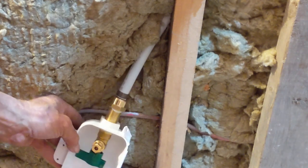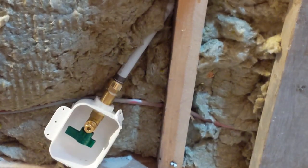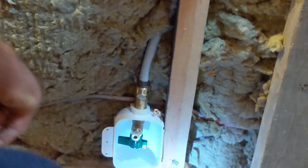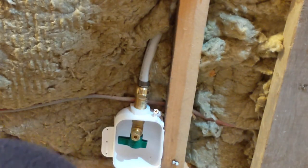Beside the box you can see there's a spot there for the drywall, flat with the drywall. I'm just gonna go with some wood screws, two and a half inches. I was able to do the screw in there — I'm still gonna put a piece of 2x4 right here, stab a few screws in there to get it more stable.